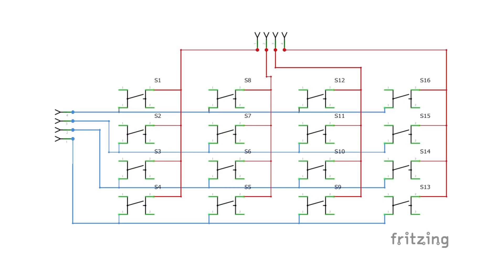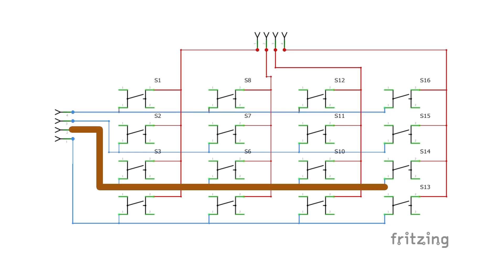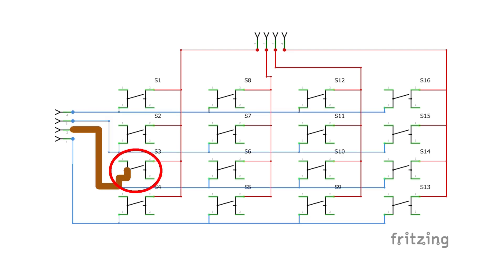Scanning of switches for keyboards is very common. The switches are connected in a matrix of rows and columns, where one side of the switch is connected to a row and the other side is connected to a column. In this example of a 16-switch keyboard arranged in a 4x4 matrix, the row acts as the supply and the switched output is sensed on the column side. By sequentially energizing the rows and then monitoring the columns, a switch press of any key can be identified.